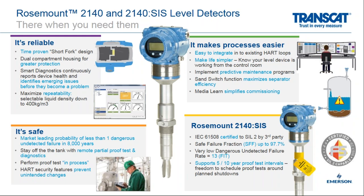So what that means is, if you had a 2140 set up to map the frequency to your 4 to 20 milliamps, I'll give you some numbers to help make that a little bit more clear. Imagine that you set up your dry condition to be 1400 hertz, and you make that 20 milliamps. And then you set up your wet condition of 900 hertz and make that 4 milliamps. So now with this device, you can map your frequency to a 4 to 20 milliamp range.